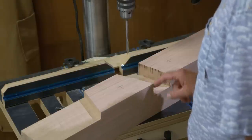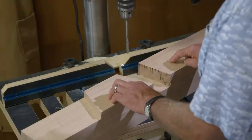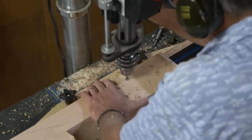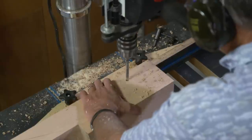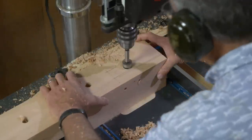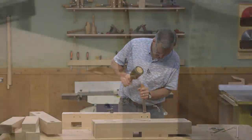With the dado cut to seat our apron and the seat for the half-lapped dovetail, we're ready to drill some holes in the legs. There are three different holes to deal with. On the front right leg, there are two three-quarter inch holes for a hold fast or hold-down attachments — the dog holes. On the side of the leg, there are four holes drilled with a three-eighths inch drill bit for the draw bore pins, which will help pull the short stretchers tight. Finally, there are two mortises that will accept the tenon from the short stretcher; I'll use an inch-and-eighth bit to hog most of the waste out, then finish with a chisel.